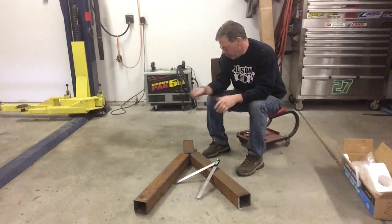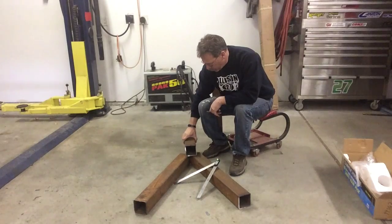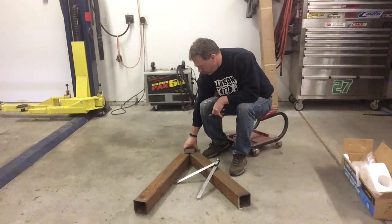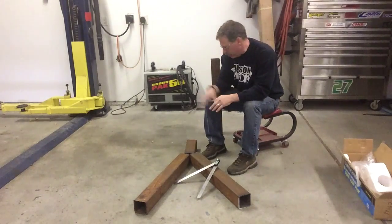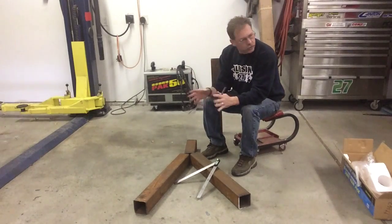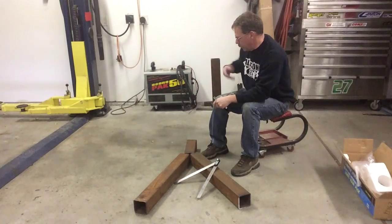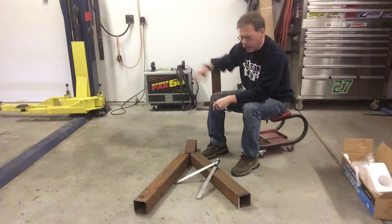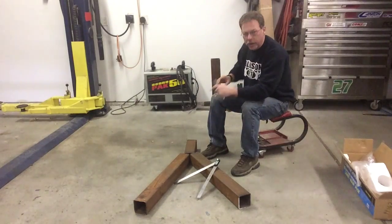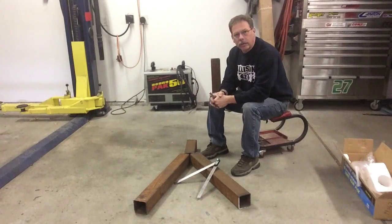It's not a very big project. I want this back leg cut about 12 inches long — that should be plenty of stability. The hydraulic ram will hang out over the legs so that the work area is on this side. I may add a couple of down bars off this upright to the floor legs.